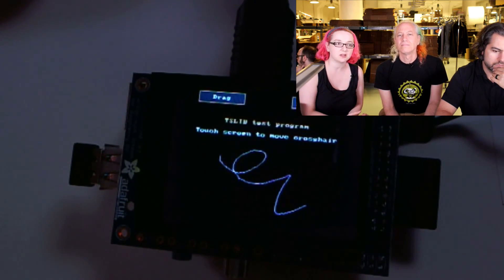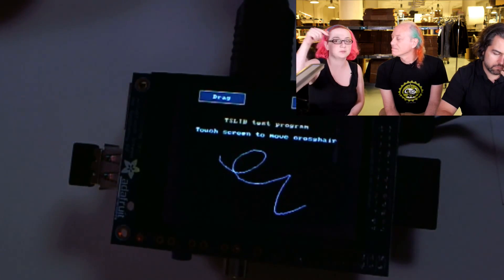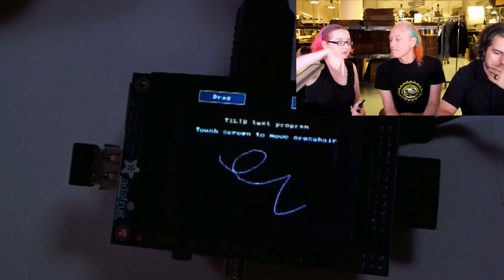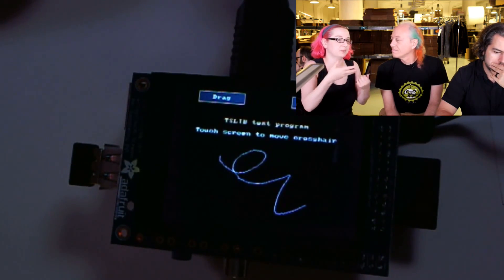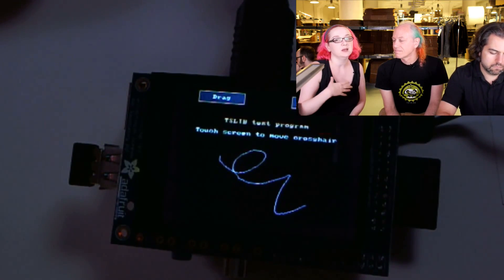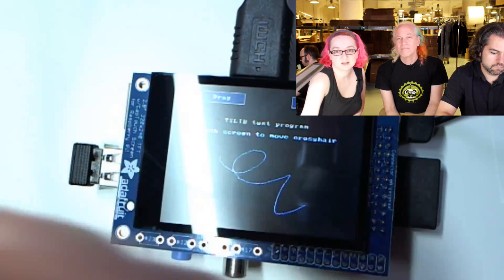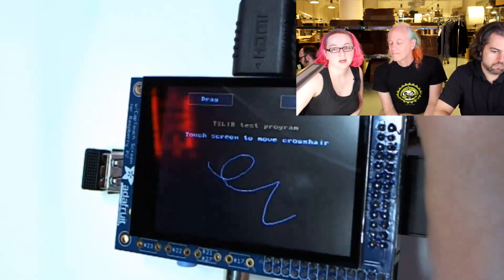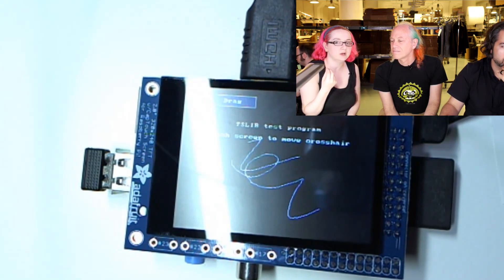Resistive touch is actually just two thin layers of plastic — when you press them you're creating a potentiometer, basically a gigantic clear potentiometer. With capacitive touch, there are three layers of glass with a capacitive grid and a controller chip. So it's $10 more — that's the trade-off. But it has a much cooler look, like a glass, black, shiny, glossy finish. It'll look much better than resistive touch, and it's much clearer too — more light passes through so the display is a little bit more vivid.